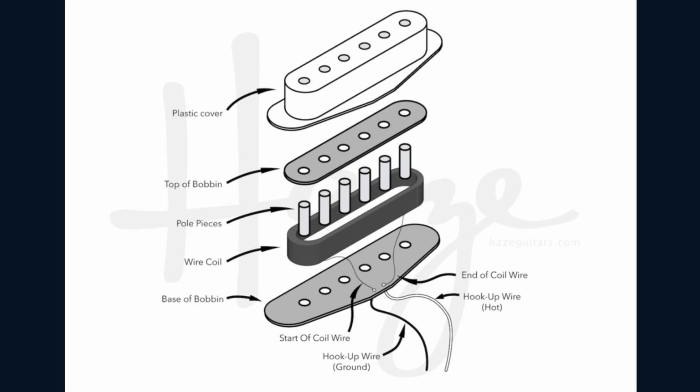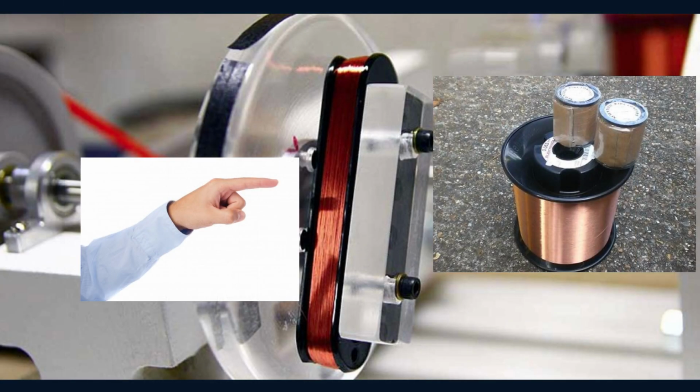With the aid of a mechanical winder, extremely tiny magnet wire with a very thin varnish layer is coiled several thousand times around the magnetic edifice, regardless of pole pieces or slugs. Winds that are quite even and calm contribute to a stronger, darker pickup. On the other hand, irregular scatter wound coils produce a crisper pickup due to the reduction in self-capacitance. As absurd as it may sound, careless, sloppy factory workers have produced some of the best classic pickups.